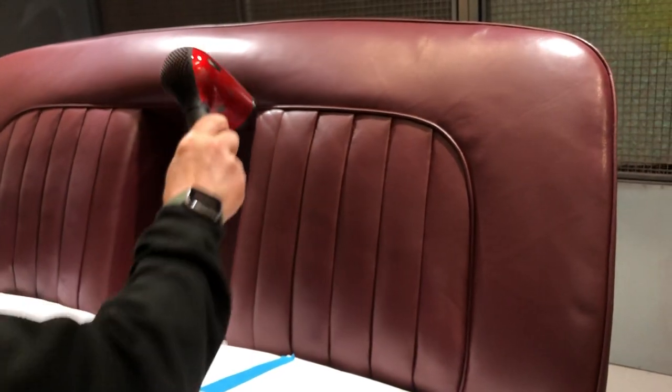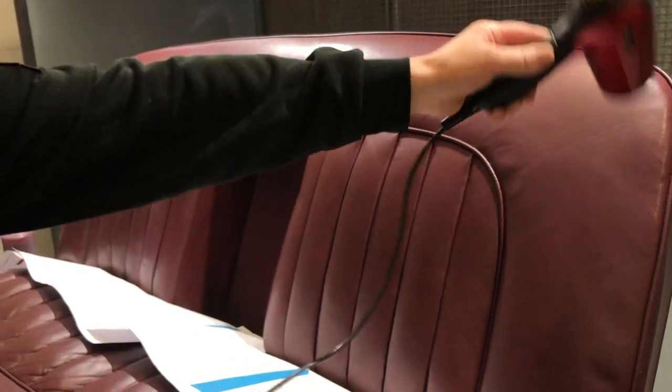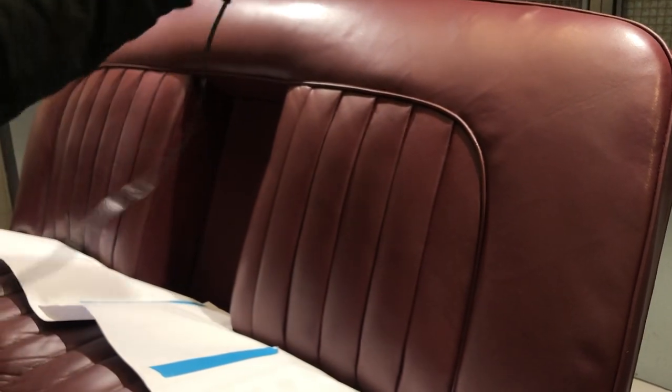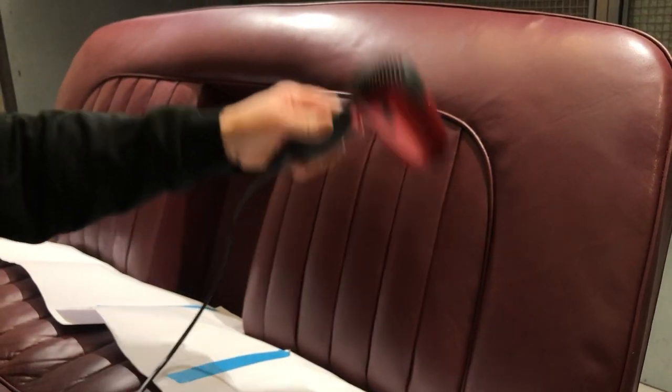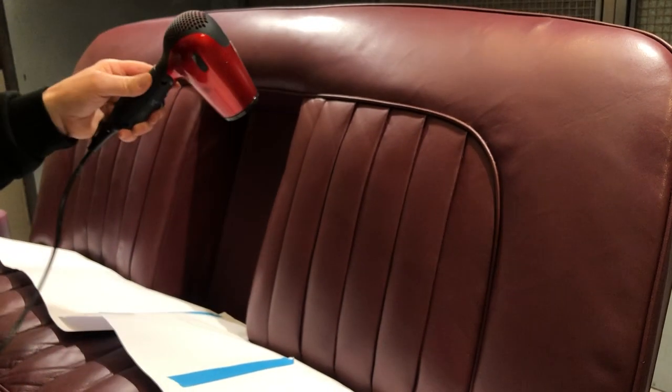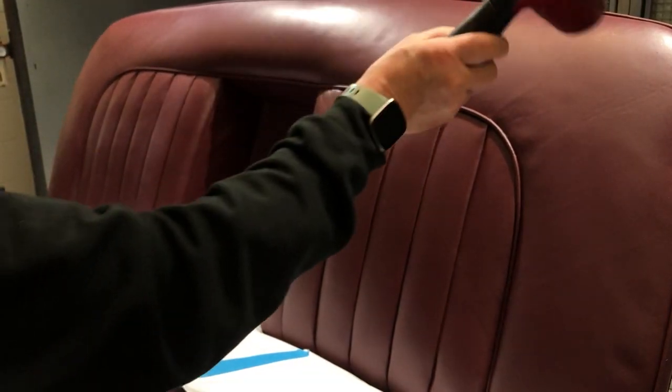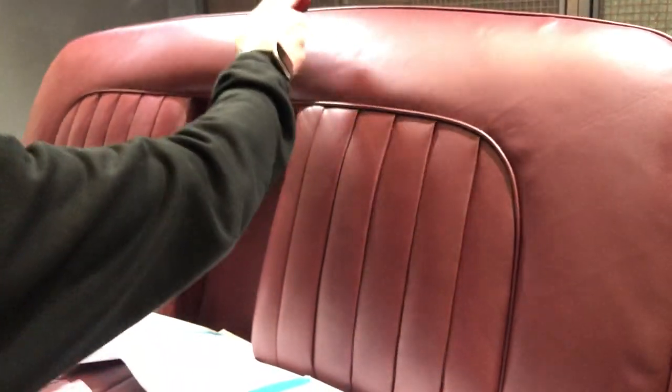So that's the last coating, that's four coats of lacquer it's had on there. That's got some really good protection on there now to protect against wear in the future, stains and dirt build up and everything else. And once that's dry, we can get the protection cream put on there, which we'll do and show you how to do that in the next video. But we're going to just show you before we go what you've got to do with this final coating now, to sand with the 3000 wet and dry paper.